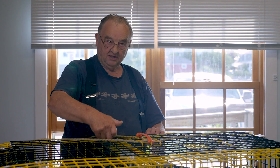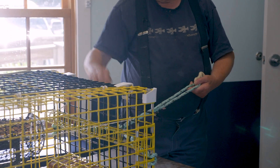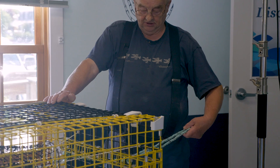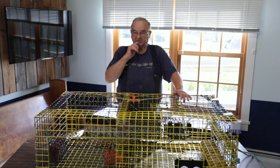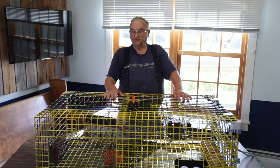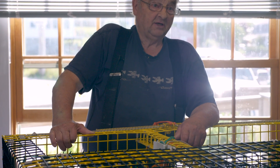That's to keep the door from swinging open. They do put dog bones on them — these are called dog bones. This is put on when the beckett is tied; there's a special way you tie this. This here is a bowline, tied right into the line. This is a floating rope that floats up off the bottom — that's what it's designed to do — and that keeps it so the lobster doesn't see it. On the top line they use sinking rope so that other boats don't get in your line when the traps are in the water. If you use floating rope on top, the boats don't see it and you've lost your traps. If you put your name tag in, most of the guys will give it back to you — they want theirs back and we like to make sure they get them back.